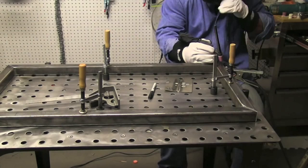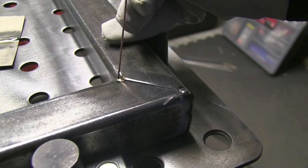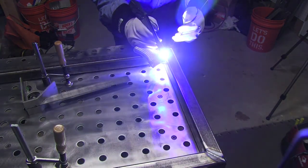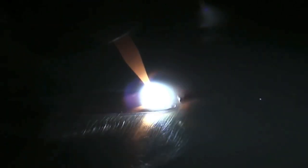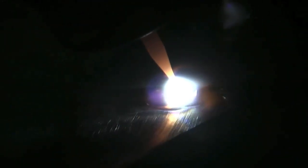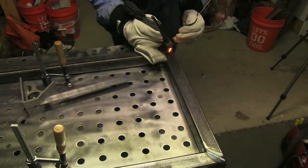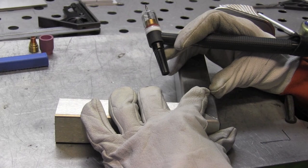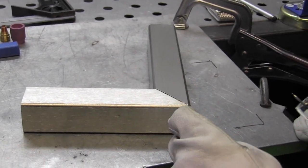If you've got a box like this — a rectangle — and you've got everything square and everything tacked up, then just welding from the inside to the outside, the direction of travel makes a huge difference in keeping something square. Starting on the inside and welding to the outside is probably the main thing. On something really big, or when you have to weld something in a free state where you don't have things tacked up, it's allowed to move, and then you have to really be careful — you kind of have to pre-place it so that it will move and be square when you're finished.